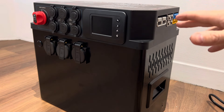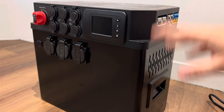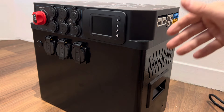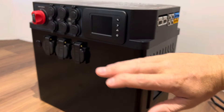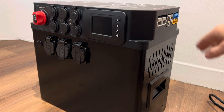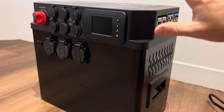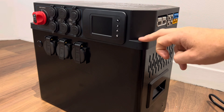That basically covers everything. It gives you a really good all-in-one box where all the components are matched. There's no need to choose what inverter or what lithium batteries to match — they're matched so they don't trip out. The DC-DC charger and solar MPPT charger are all in there.